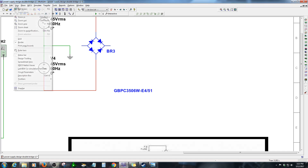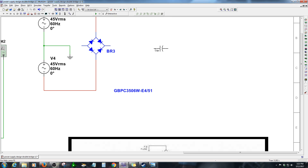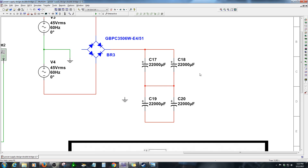Let's go with a 22,000 microfarad capacitor. I'm going to place it here - press Control R to rotate the component. We'll make another one, for 44,000 microfarad total capacitance. That's what we usually do for a simple audio amplifier. This is the connection we are going to use, and the center tap is this node right here. I'll place the ground at the center tap.